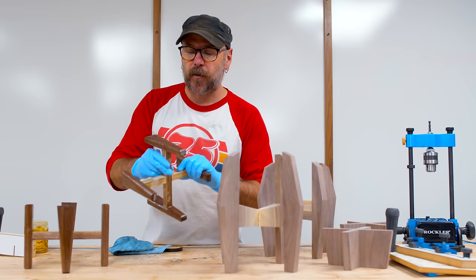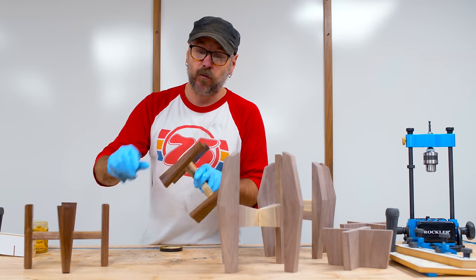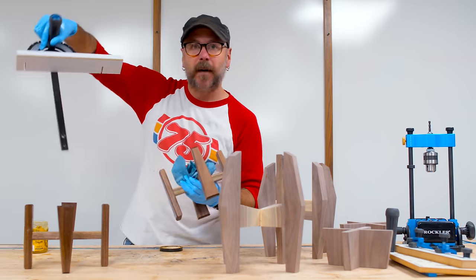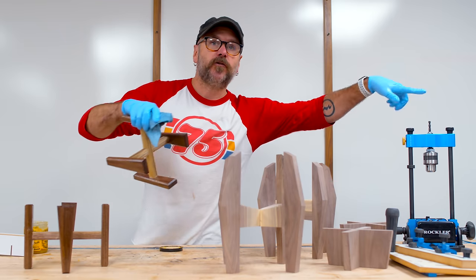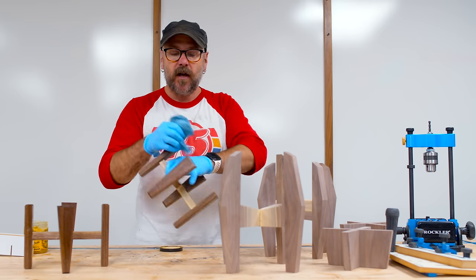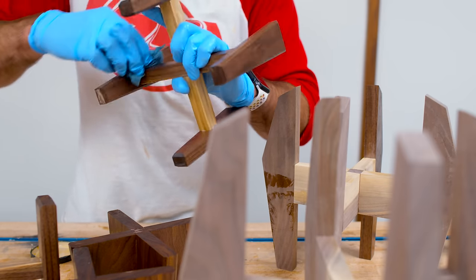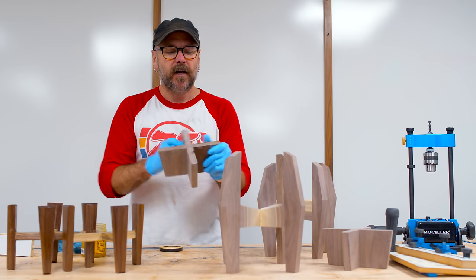All of these planters were made with that small parts tapering jig. Not only does it keep you safe because it keeps your hands away from the blade, but I was able to batch out a whole bunch of these really quickly. Using angles in your projects and your designs breaks away from that boxy look that I find myself getting stuck into. I also use their miter gauge at the table saw — you can get an optional fence for that and it's all really high quality stuff. The drill guide over here — if you don't have a drill press, this is what you want. Thank you Rockler for sponsoring today's video. I'm using Odie's oil — you can even get this at Rockler — and I like the way it looks on walnut. It's quick and fast and easy to work with; I don't have to wait for any drying time. I just wipe it on and then wipe it off.